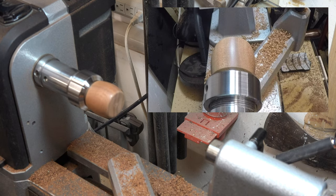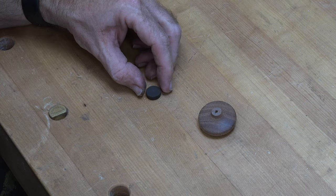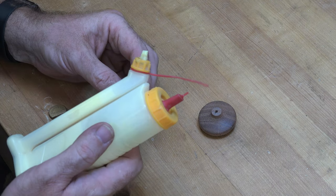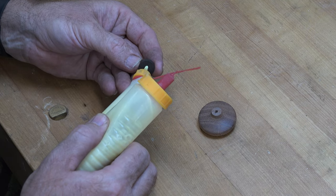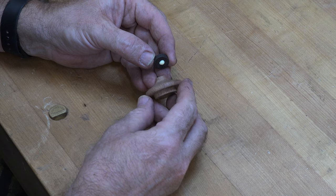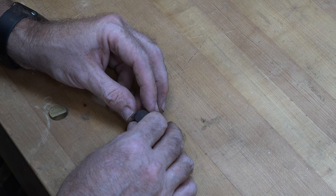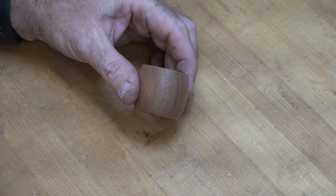Let's take this over to the bench and see what we have. At this point I have taken a piece of ebony, used a plug cutter, and cut a five-eighths diameter plug — it's about an eighth of an inch thick ebony, just an off cut. Either way, we're going to glue this on top of our mahogany lid, clean up any squeeze out, and then let it cure.